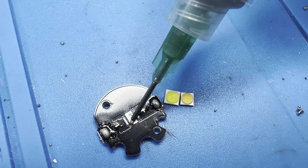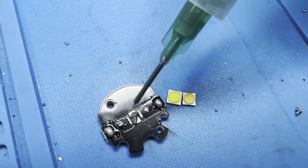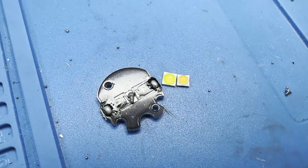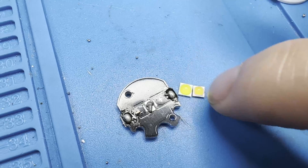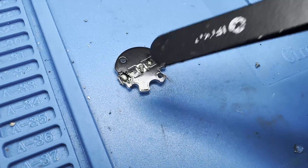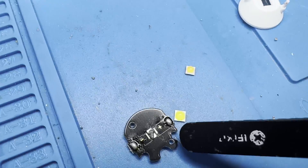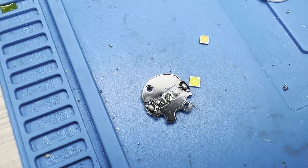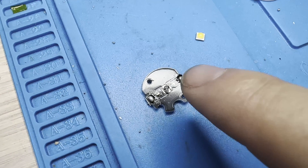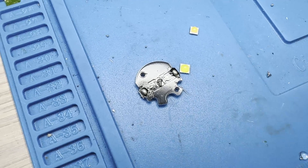When you go to use your solder paste — even if the pad already has solder paste on it — use a little more than you'd expect, more than is typically used. When I put the emitter on, I normally tap it to squish excess solder out. I'm not going to do that here because I want it to float just a little bit, so that it makes good connection to the larger pad when it's a smaller emitter.